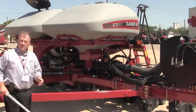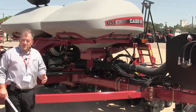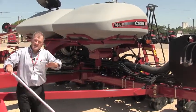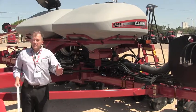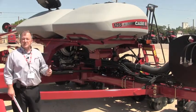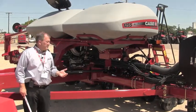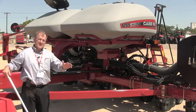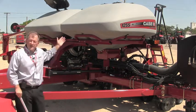We redesigned the entire bulk fill tank to accept seed through the lid opening at the top without any pushing of the seed required by the user, keeping people away from seed treatments and saving time and hassle of having to handle the seed directly. It should gravitationally fill that hopper right up to the top.